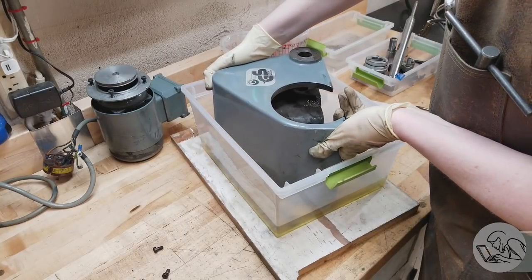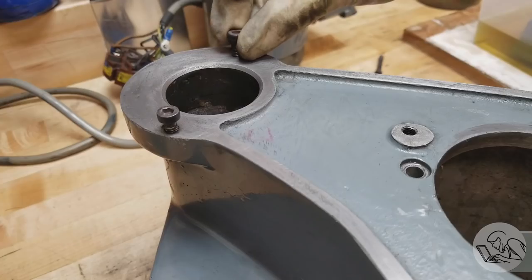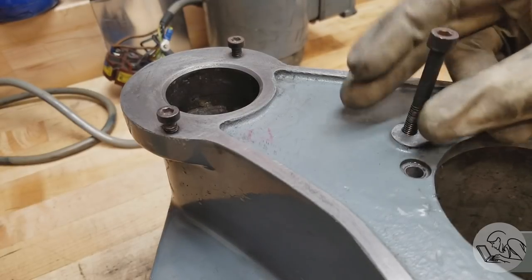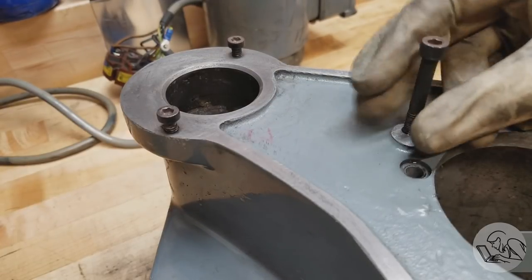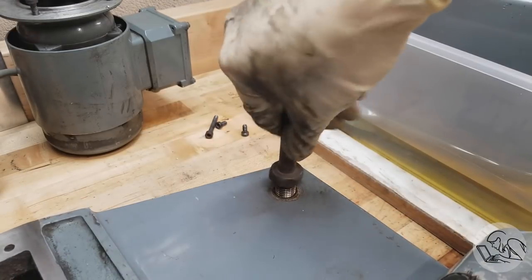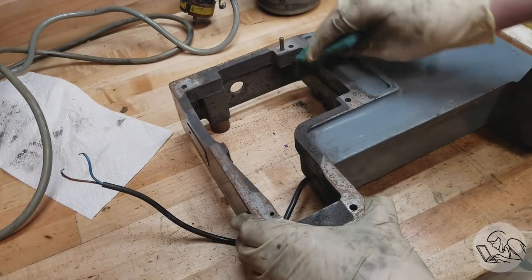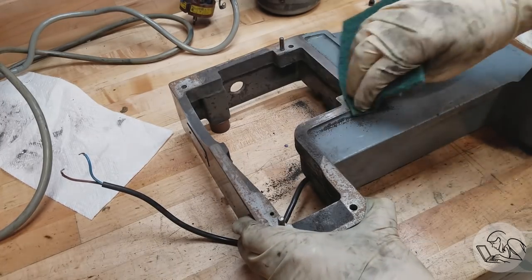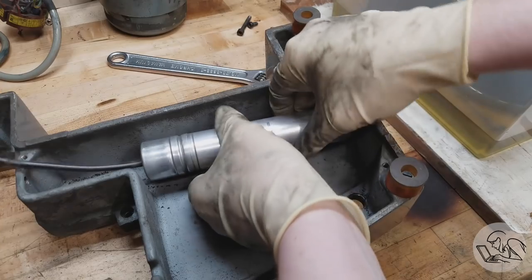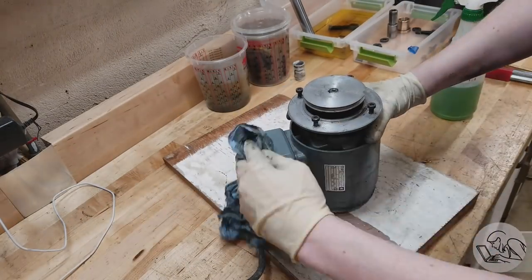I do the same with the other mating surface on this casting, and that also came out like new. As I go along, I'm just putting screws back where they came from, because while it looks like rapid succession, some of these sessions are weeks apart and I don't remember where everything goes. That post comes out of the bottom casting — I think it's an accessory post for mounting a lamp. The base casting is too big to dunk even in my tank of Evaporust, so I'm doing mechanical removal of the rust on that. Then I unscrew the motor capacitor from underneath and give the motor a little bath using Simple Green diluted one-to-one.